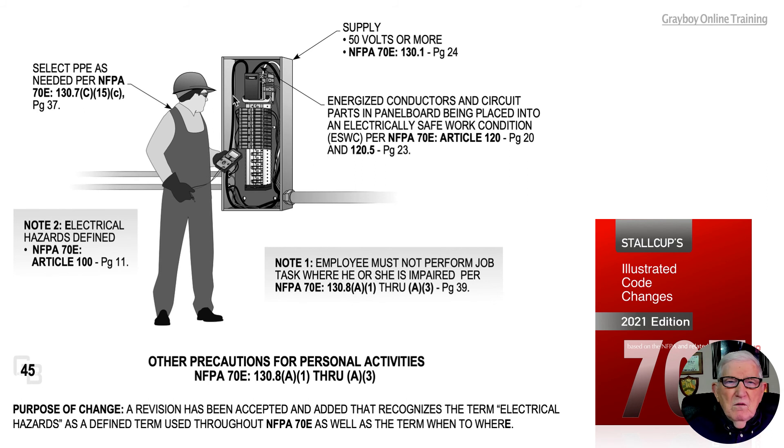Any time a person, as shown in this illustration, tests on energized circuits and equipment, they must review the energized rules in 130.2C on page 24, and 110.4A and B on page 15, where equipment is energized, what the exemptions to the rule are, and how working on energized equipment at 50 volts or more, or less than 50 volts, is addressed. Review those very carefully before attempting to work on energized equipment.